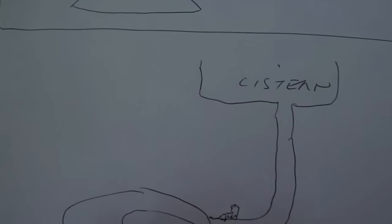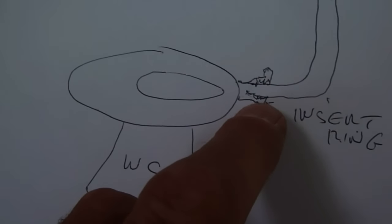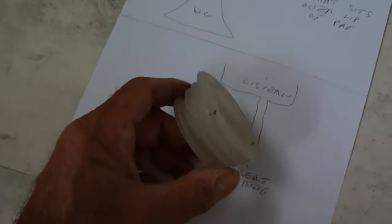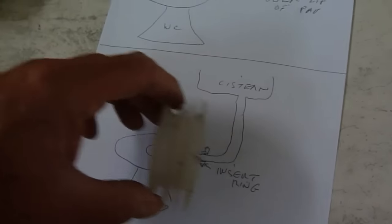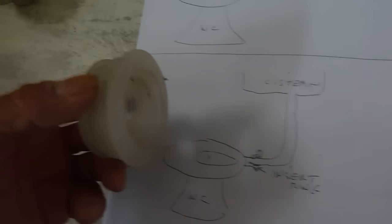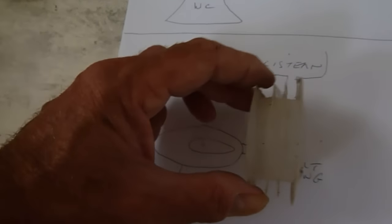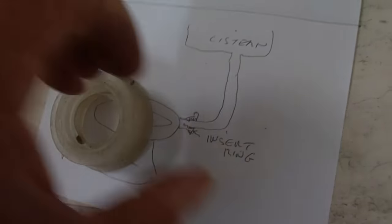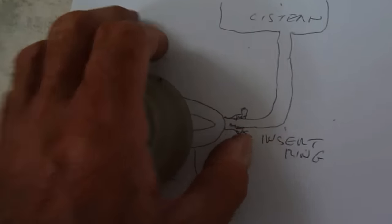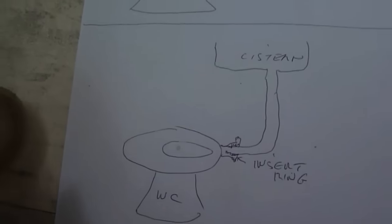More normally if you've got a flush pipe, you'll have what's called a pan insert. You'll have one of these - a plastic insert - and that pushes into the pan and onto the pipe. What you do: take the pipe off, take the flush cone off, knock the old insert off because it will be gone, and push this new one onto the pipe. Before you insert it, put the pipe back in and push it back into the joint, making sure it's tight back to the lip of the pan. Then fit the flush cone and do it up, and that will cure the problem.